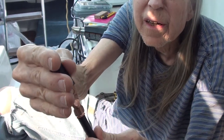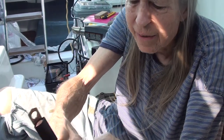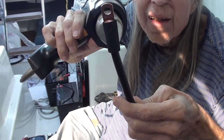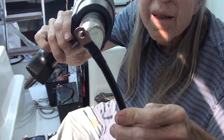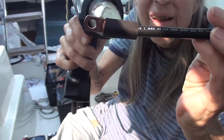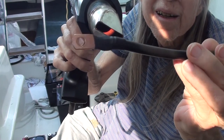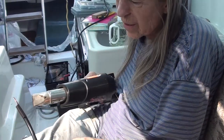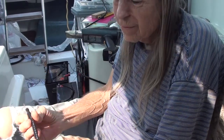That's what it looks like with the crimp on. Give it a good pull test — it's not moving, probably going to be okay. Heat shrink tubing, because there's a little bit too much copper there and it was too close to the other bus bar. So that shrinks it nice and tight. Now I'm just going to do a bunch more like that. See how nice — it's been heat shrunk.